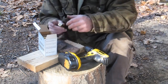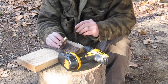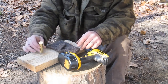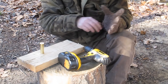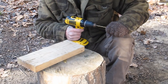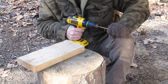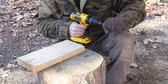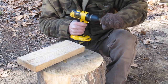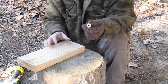What I suggest you do is get a set of drill bits and just feed one through one of your shotgun shells until you find the one that slides through the way it's supposed to. You can chamfer the edge a little bit so the primer seats all the way down. I just drilled a straight hole — I believe this is a 15/64 drill bit. I grabbed hold of it, stuck it in dead center, drilled it out, then wobbled it a little bit to make sure it was a good clean hole, but I don't want to oversize it or it's not going to seat properly. Once that's done, the shell is set up to take a 209 shotgun primer.